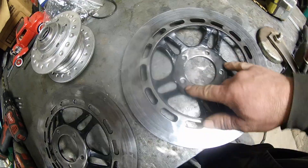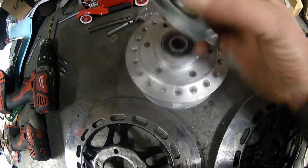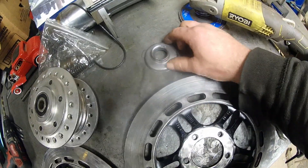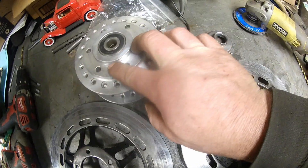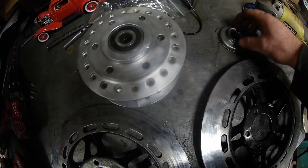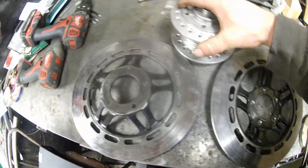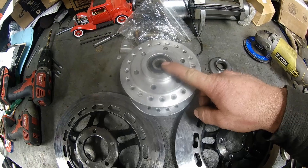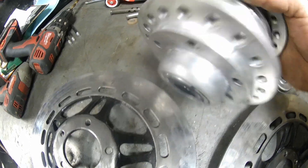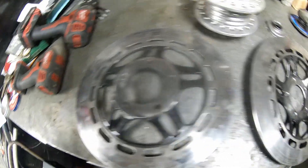So I'm going to fill these holes on both rotors, front and back, clean them up, and then re-drill them. We also have to fix this piece here — we'll have to cut this down to a smaller diameter, take about half a mil off, and then drill and tap so that it will fit on there. That's for the speedo. We'll take half a mil off each side of this face and fill these holes and re-drill the bolt pattern.